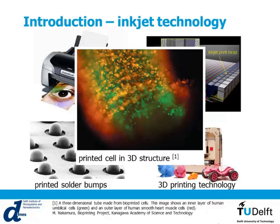Of course it is not very important if you have a missing droplet when you print a paper, but when you print a TFT or a flexible display or an organ, then if you're missing a droplet, this can result in the end in a missing pixel or even a missing part of an organ. So that's not something that you want, of course. It is very important that we make sure that all the droplets are very precisely fired, and we know that they all have been fired.